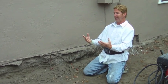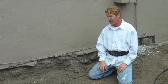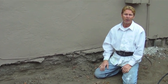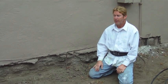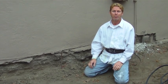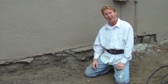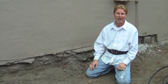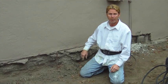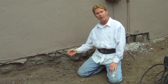Then when we come to do the plaster, you might have noticed this stucco here — it's about one inch to six inches thick in some spots. Now we're going to be using a product called RapidSet. On their website there's a fella applying this product putting it on six inches thick, coat after coat after coat. Here's a perfect example of why somebody would want to go six inches thick. After we get this prepped properly, I'm going to apply coat after coat to build it out in areas where needed.